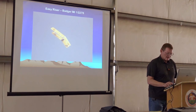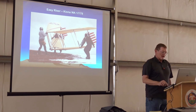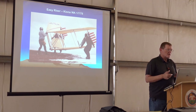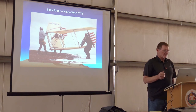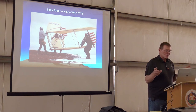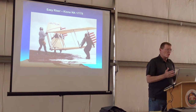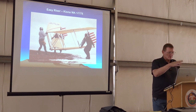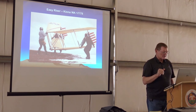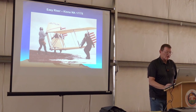How much did this one weigh? This one was 50 pounds. So same wingspan, 170 square feet, 50 pounds. It was delightful to operate. Because the rudders were larger, you can see they're about 30% bigger area. They're also inboard, and the polar moment of inertia in roll and yaw was less. This was quite snappy. It was really fun to fly.